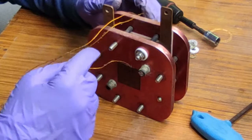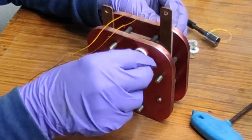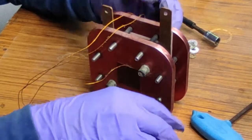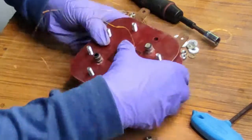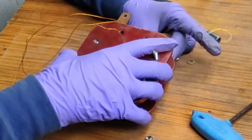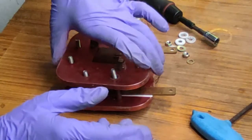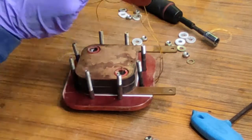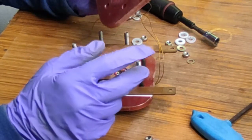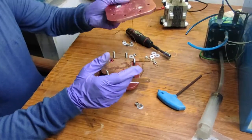This is a heater just to heat the fuel cell. Now I have removed all the bolts — I am removing the final bolt of the cell. We have to be very careful while removing the bolt so it should not fall suddenly. Now I am removing the end plate. There are two end plates in a fuel cell: one for the cathode side and another one for the anode side.